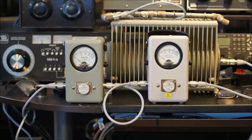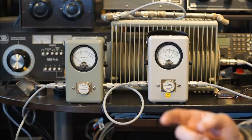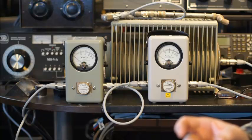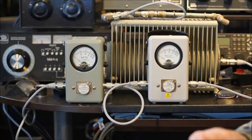I'm back. It took a few minutes to set it up but I think I've got it in focus. First I'm going to transmit into the two watt meters and into the dummy load — it will not be going out over the air; I don't want to interfere with anybody. 20 meters happens to be wide open to Europe right now — it's 10 o'clock in the morning. I'm going to key in tune mode the Elecraft K3, which will key the KPA 500 amplifier. I don't need 500 watts — I'll drive it with about 10 watts, with the KPA 500 putting out 100 watts, which is easier on the transceiver.